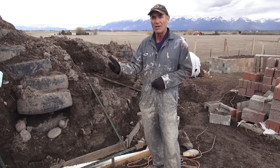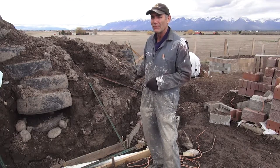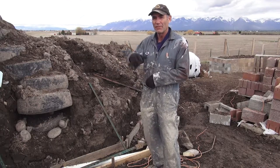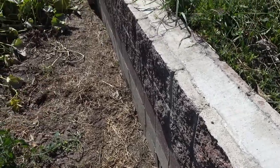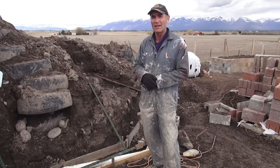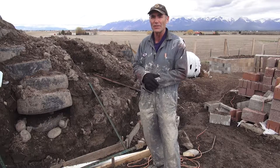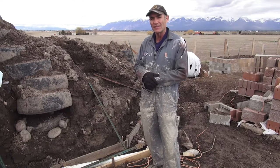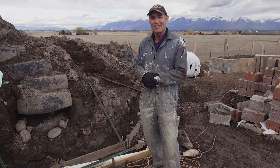So I'll have that truck come out with the 3 yards. We'll use it probably about maybe 3/4 of a yard in this wall for those columns, and then we'll put a bond beam across the top to hold it together with some steel in it. I have some slab work to do inside of the greenhouse, so I can do all that at once for 3, 3 1/4 yards. So that'll save my back and save my hands and save some labor. All right, let's get started.